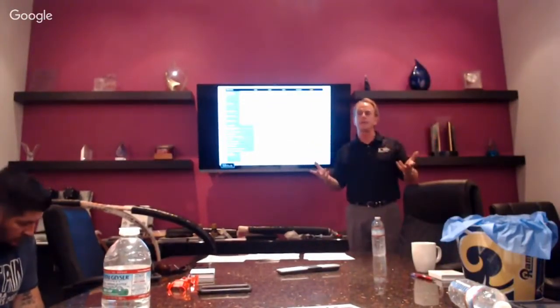So if you have a 4420, which is our 1.5 horse, we have 3 sets of glycol lines going out. That could be 3 conduits, 12 lines or less, or a 12 line and a 16 line. Remember, the 16 line has 2 sets of glycol lines.